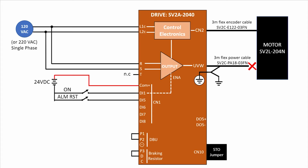Finally, I added a normally open switch to reset alarms and a normally closed switch so we can test the motor override. Think of that as a simplified e-stop, but without all the required safety stuff. Now, we don't have over-travel limits because we don't have a real machine. So I just wired them like this to simulate their normally closed operation to prevent them from generating faults.